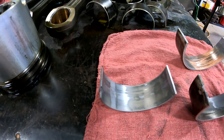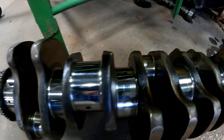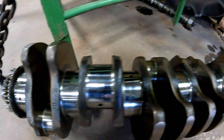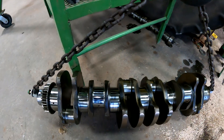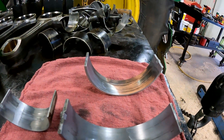I'll show you what happens when you go beyond that interval and get worn down to this. We've got this crankshaft out here, and looking at this main journal that the bearing was running on, you can see those scratches in the crankshaft. The crankshaft is definitely not ruined by any means, so we're going to send it off and get it polished before we rebuild. We call doing just the rod and main bearings an underhaul — that's basically what that is.